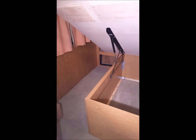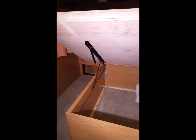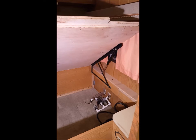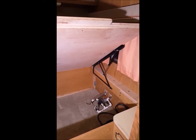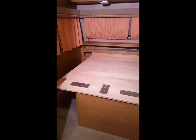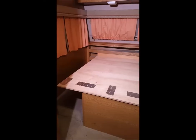We also needed space for our dog and extra storage, so we extended the platform past the base of the bed. We kept the queen-size mattress, so our bed was wider than a 4-foot sheet of plywood. This issue was overcome by using a combination of wood and metal mending plates to extend and secure the platform. It was also necessary to make adjustments at the head of the bed to keep the platform from hitting the valance above the window. We added a vertical fence at the back of the bed to prevent the mattress from sliding off the platform while in the up position.